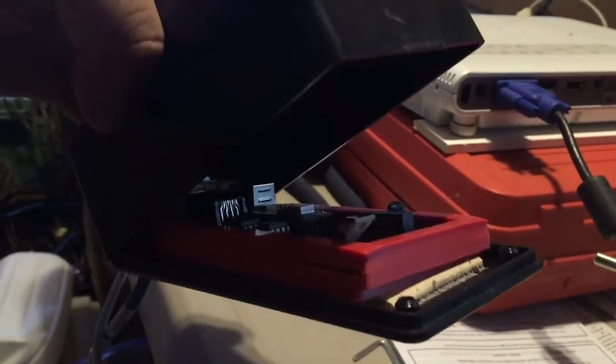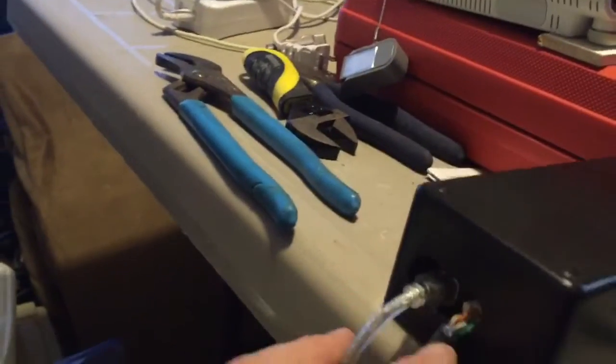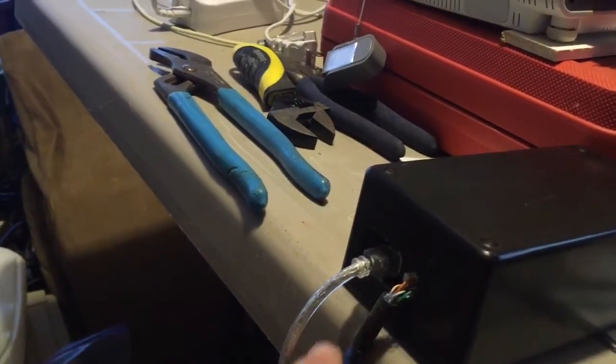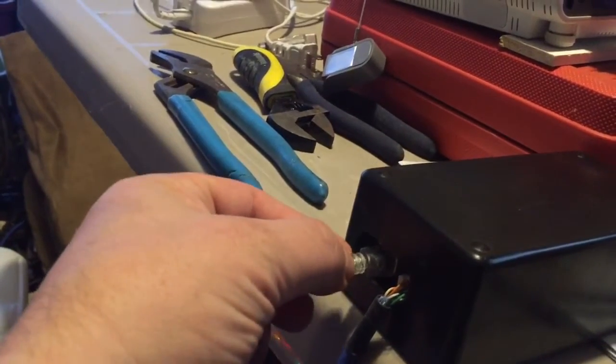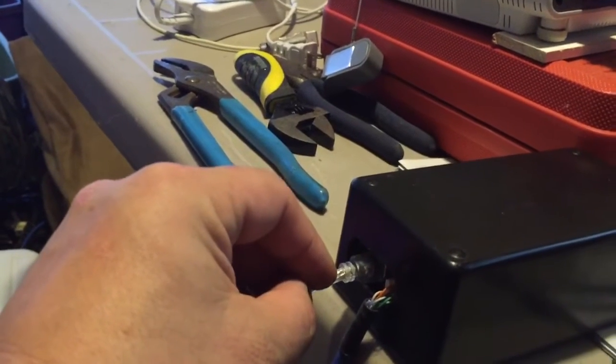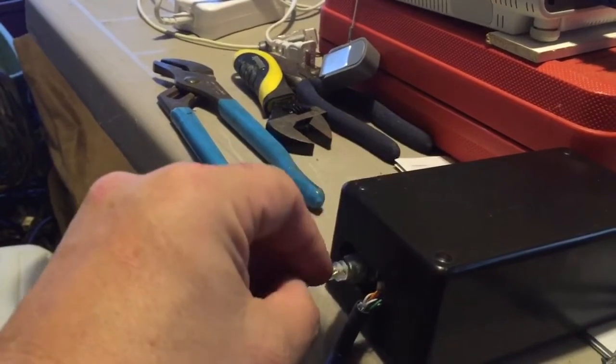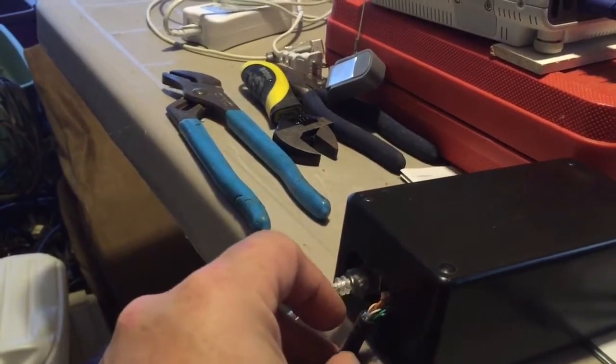So my cable comes over here into this box where I have a DMX to USB device. Let me open that up. And there's a small circuit board in there, so I have DMX running out through here to that box, and USB is being driven from the computer to this box. And so it's basically converting the digital data for the pulses that are going through USB into DMX